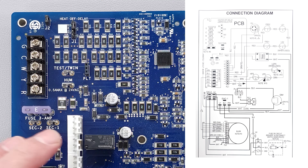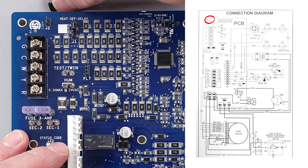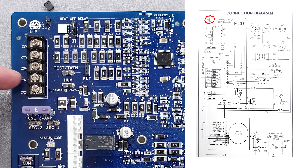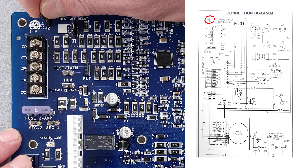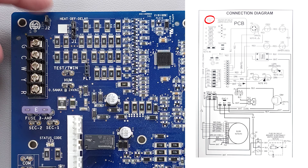Since we're talking about jumpers, this little J2 jumper right here is the cooling off-delay defeat jumper. With that removed, it should be able to turn the fan motor off right away any time that you lose a signal on the Y for air conditioning mode. But we are typically going to leave that in because you want the fan motor to continue to run even though the compressor has shut off - maybe the indoor coil has water all over it and it's low in temperature, and you just want that fan motor to run for that additional say 90 seconds after that compressor turns off.